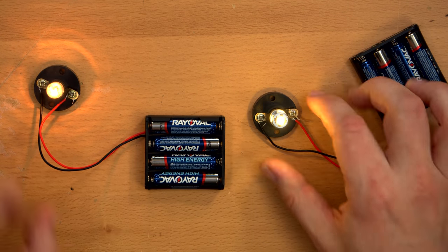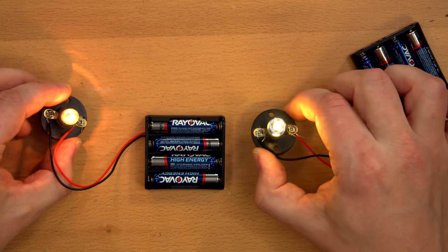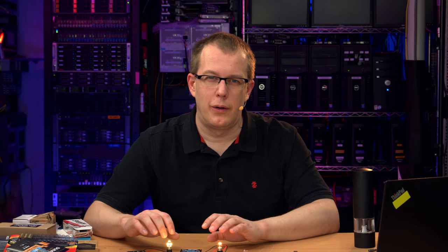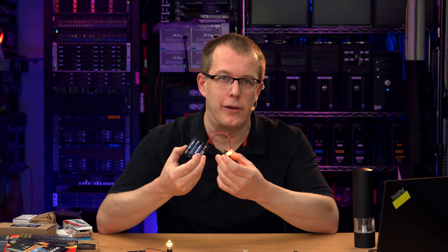This right here is an incandescent bulb, so it draws a fair amount of power — think of an old school flashlight. It's not going to last as long as an LED flashlight that produces about the same brightness. And in fact that's what's going on here. This is an LED bulb — it's glowing probably about as brightly, maybe even more brightly, but it's using about one-tenth the power of this bulb. Why do I have two different types of bulbs? Well, when I first wanted to test these, I had to test 15 different styles of batteries at once.